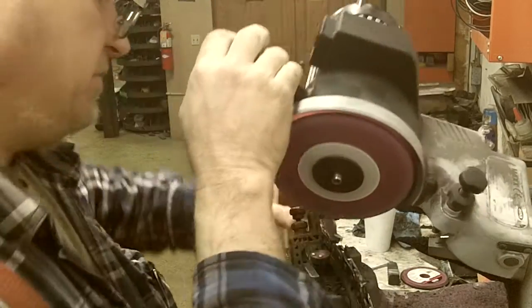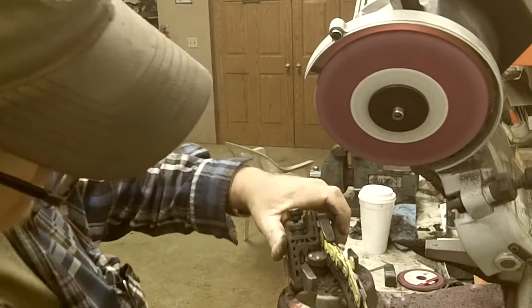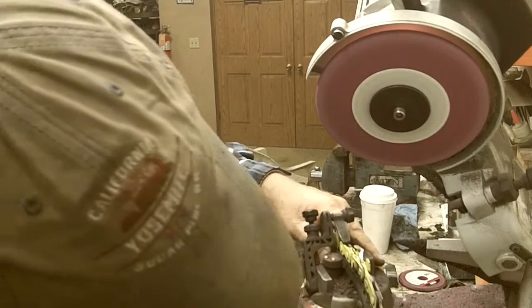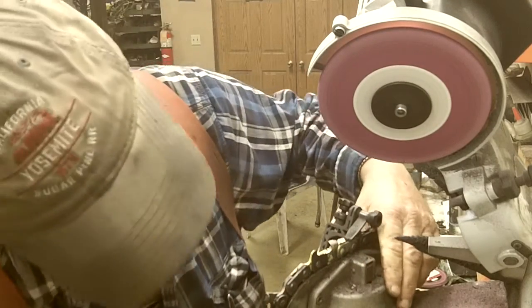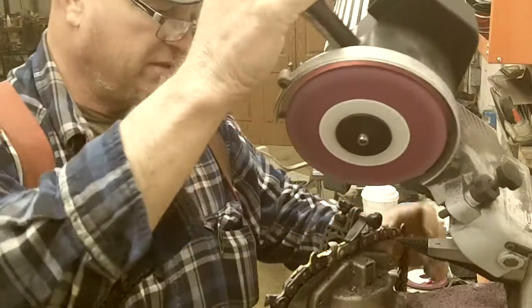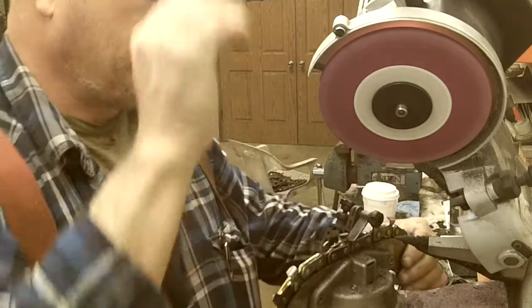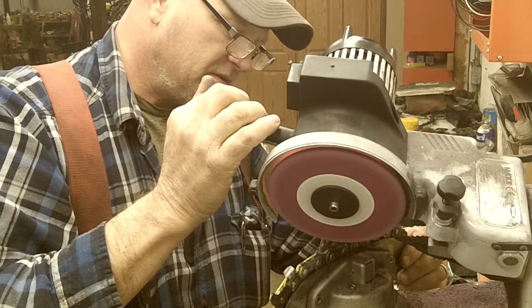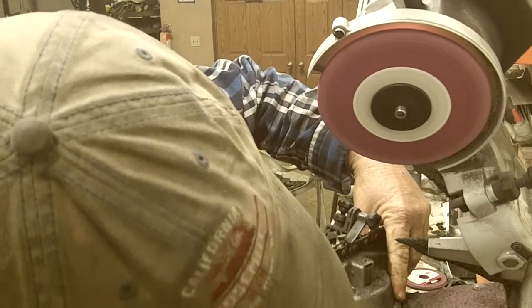But other than that, for some reason that tooth's not set like the others. But there, that's one side. Now what I'm going to do, change my angles here. Run it to 30 degrees the opposite direction. I'm going to find the center of the cutting wheel. That will change my pitch on my gullet. Will do the same. Pretty good. So we want about 5 degrees.